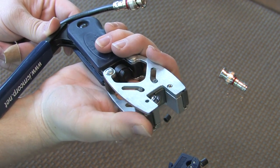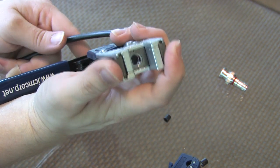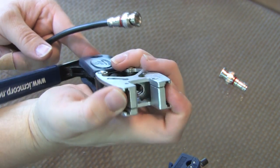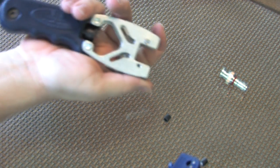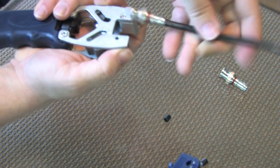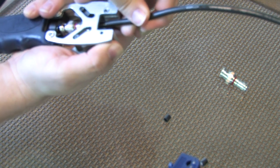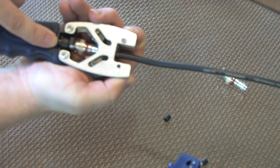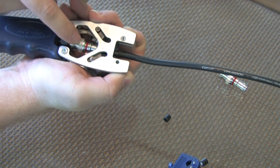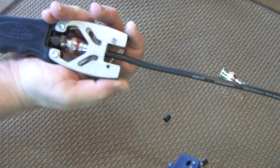On the compression tool you'll see jaws on the end that you can pull back. When you do that, the size of the hole on the inside opens up. Take your thumb and forefinger and pull back on both ends at the same time, opening the jaws all the way. You can then insert your BNC connector, seating it into the clip on the back side of the compression tool — there are spring retention pieces that'll hold the BNC in there. Once it's in all the way, let go with your thumb and forefinger and let the jaws go back into place.